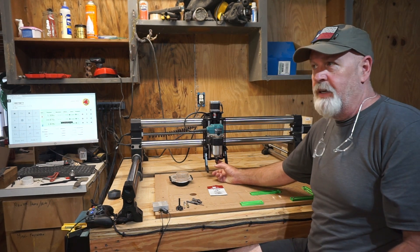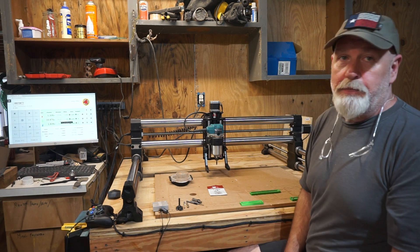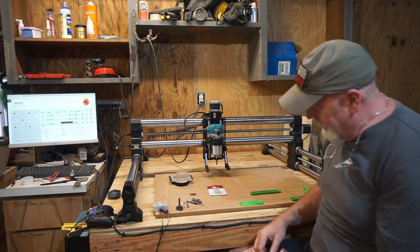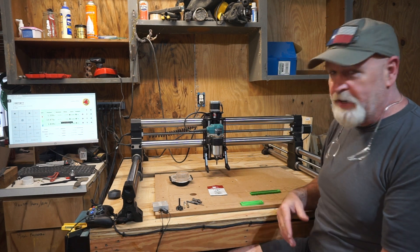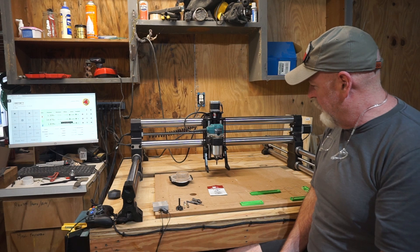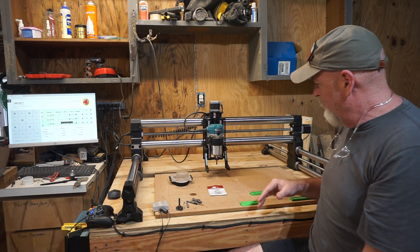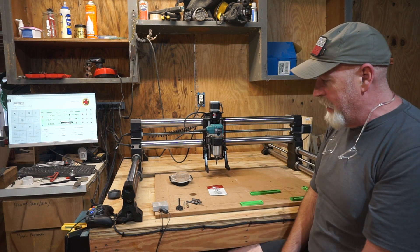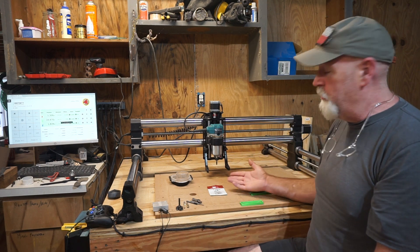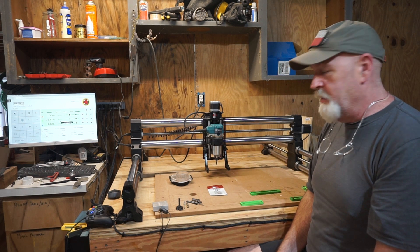Last thing: safety. A 16,000 RPM router with a tool steel bit — if you get your finger under there accidentally, it's gone. The weird part is you're watching it carve and it looks so cool you want to reach in there. I've caught myself sweeping stuff out of the way to see better, then realized that's not where my hands need to be. Safety glasses too — this thing throws a lot of chips and dust in your eyes is painful.